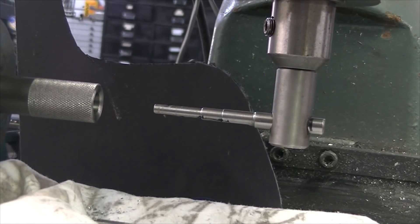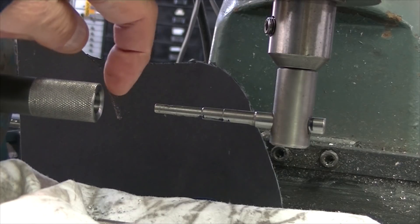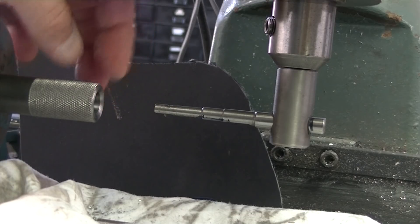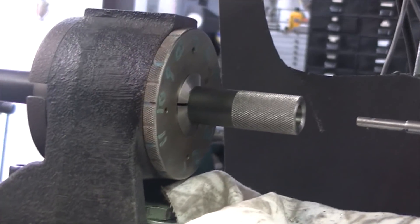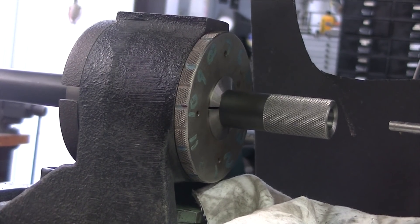This is all done after I've got the barrel centerline picked up. I set my zeros with the zero actually down inside the barrel — I'm coming up and touching the cutter off the top, checking the cutter face against the face of the barrel with a gauge block, and setting that to a specific distance. For 12 flutes, I used a 24-position indexer and grabbed every other slot.